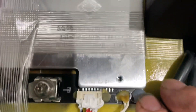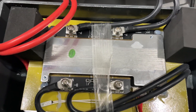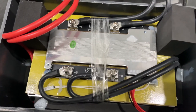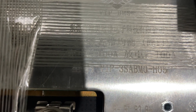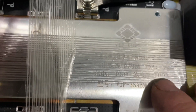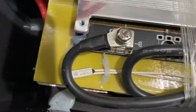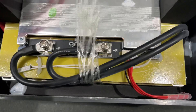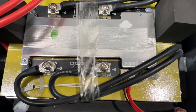This is a VIP BMS. A quick Google and nothing in English came up that I could make much sense of. The part number is VIP-3SABM0-H05. You can see it says 100 amp and other text in Chinese I'll need to translate. It actually has a 75 degree C temp probe strapped to the side of it — so that's a good start. They don't even state that in the spec sheet, so that's a bonus.